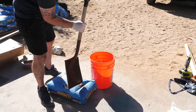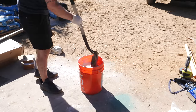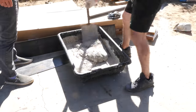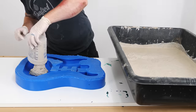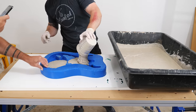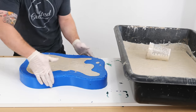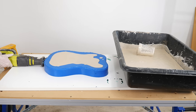I started by mixing the concrete in a bucket, but I added way more than I needed, so I moved the mix to a plastic mixing tub to add enough water to get the concrete to the right consistency — something akin to pancake batter. Next I could get the concrete added to the mold, doing this slowly and making sure to fill in areas where large voids could create big air pockets. I scooped the concrete into the mold using a mixing cup, which really allowed me to take my time and add concrete where I needed it.